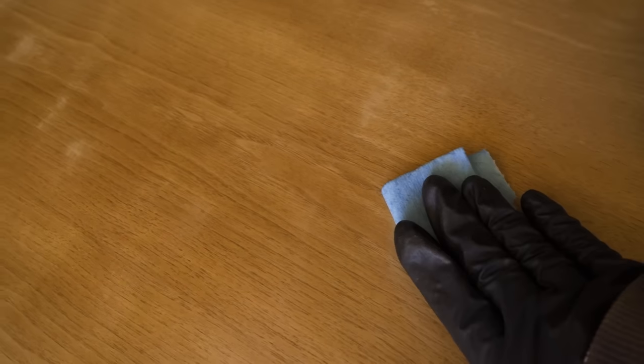I've got this light spot, but if you wet it down it's not as drastic — so it's not a disaster by any means. I'm just going to have to sand the surface to even it out and remove this little bit of color over the whole thing. I was going to sand it anyway because I'm most likely going to be staining this, and right now it's too smooth for stain — the surface is almost burnished from the steel wool.